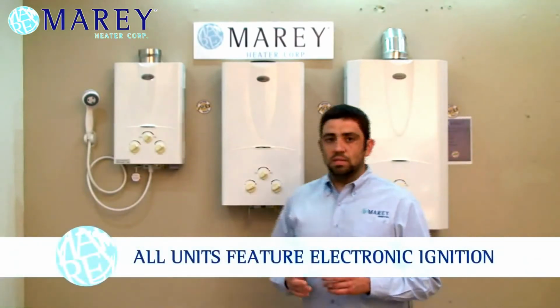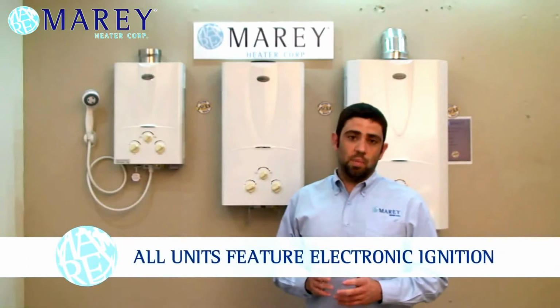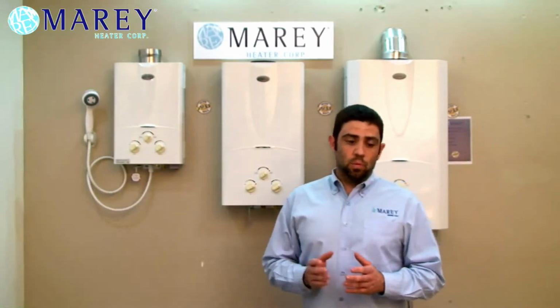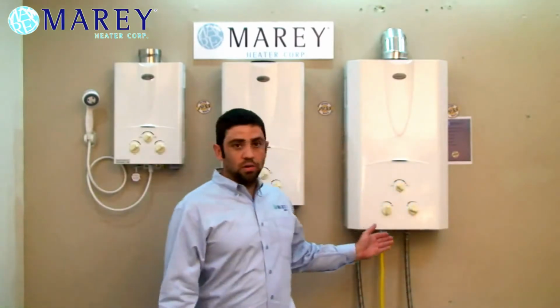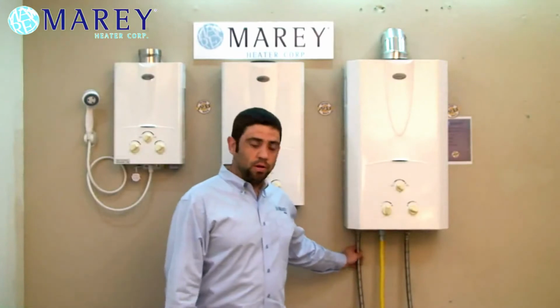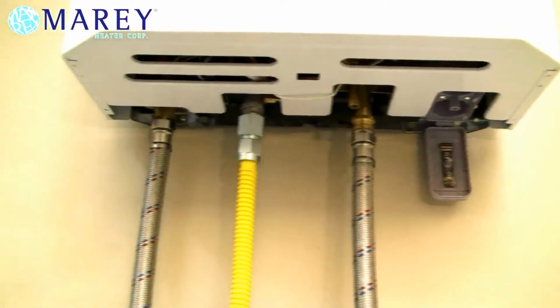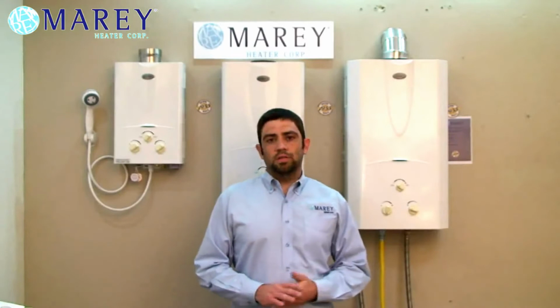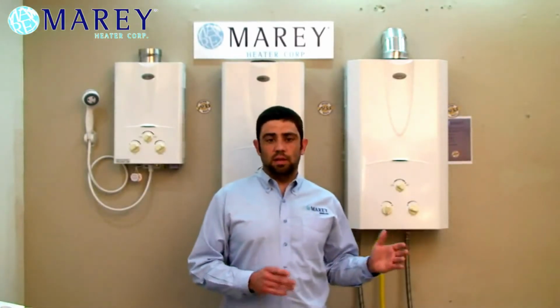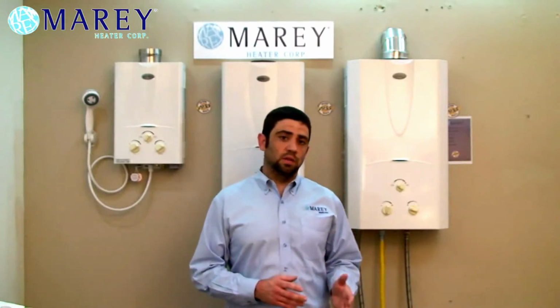The way these work is it's got an electronic ignition, so there's no standing pilot light. It's activated by water flow, so you can see this unit is actually installed, and you have your incoming cold water here, you have your outgoing warm water here, and you have your propane connection. When you open a hot water faucet inside the house, that allows water to run through the unit, and it automatically ignites the ignition, which is powered by 2 D-cell batteries.